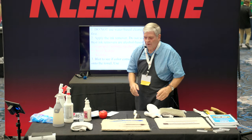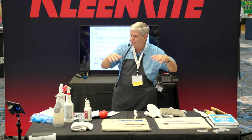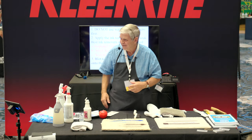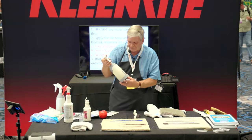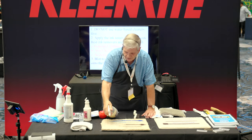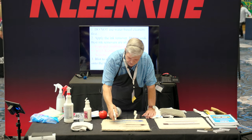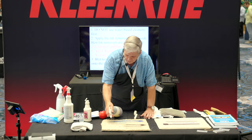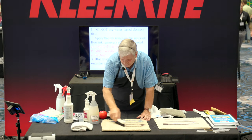Okay. So if I don't get it all out, what do I do? Now it's water on it, right? So now we go back the reverse direction. You get lost in the forest, you go back the reverse direction, right? Since it's water soluble, we go back to the co-solvent. You guys that are using traffic lane boosters, the boosters work really good. They're also a blended solvent. So here's the traffic lane with the booster. Because it's wet and water soluble, we'll use that first, because the last thing we did was rinse. So we go back to the water solvent first. We can try to just re-agitate it and it usually will get the rest out.